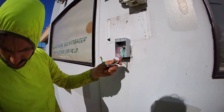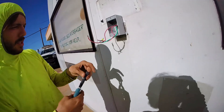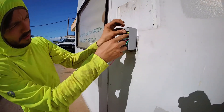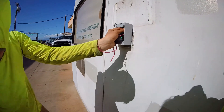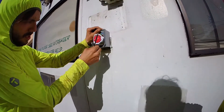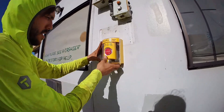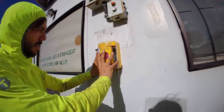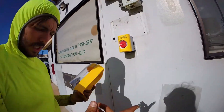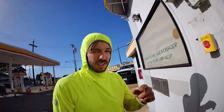Now that I have these loose ends here I'm going to strip the ends. You'll get used to these new strippers that go up to number eight. The ground wire I'm going to land on the ground screw that comes with this exterior rated weatherproof box. My new switch — so we just put this on. Now this is going to go on top — it barely is wide enough but it barely is deep enough. But that is fine. We're going to go get that other switch up and running so that we can turn the pumps back on.